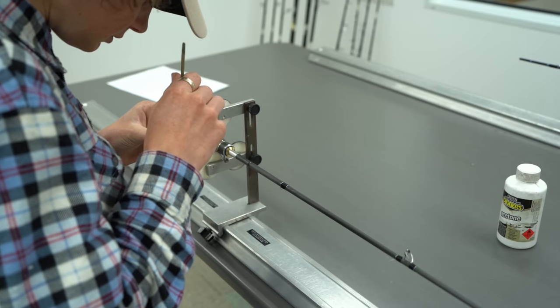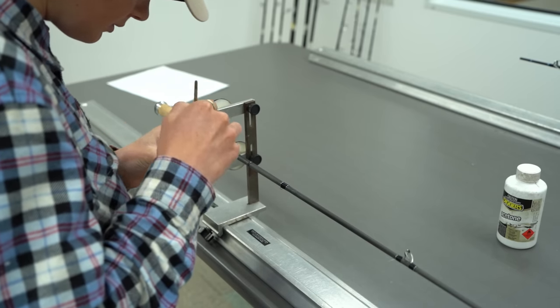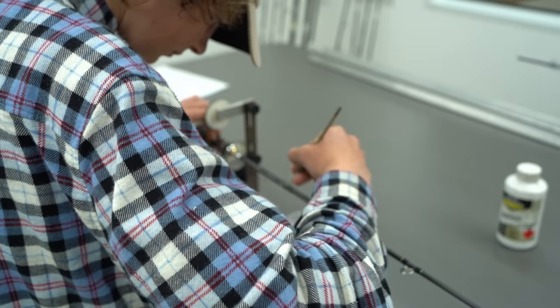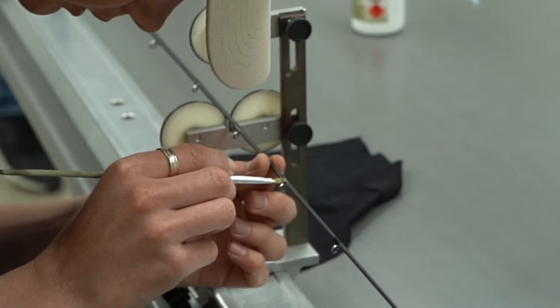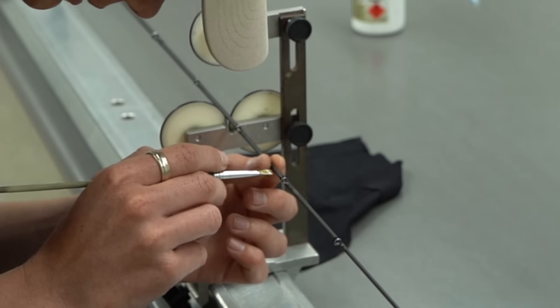Get your brush in there and wet your brush up. Completely? Just get the bristles saturated. Otherwise you're going to have the shitty looking dimply thin paste on there. If you get a good amount on and spread it lengthwise, it'll level up nicely for you by spinning the blank. Yeah, that's a full half inch error.